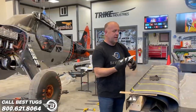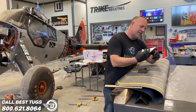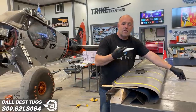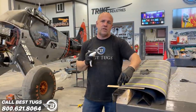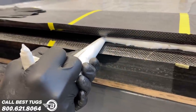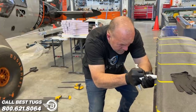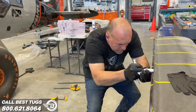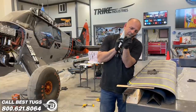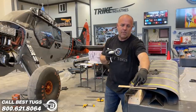I've got the middle end bonded, but the bead coming down this back edge, I want to be a little better than 3/8 of an inch of material. So what I've done is I've just put two paint sticks, which is a 1/4 inch, but I'm gonna squeeze it in and make sure it touches both sides of the gap that I've got down here where the ends meet. I'll squeeze it in, it'll touch the 1/4 and I'll go a little bit longer and I can watch it run a little bit further back and keep my eye on it as I back up down this line because it's held apart.